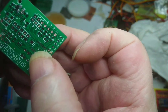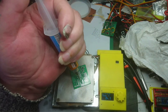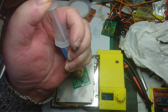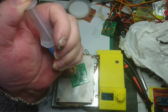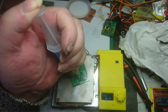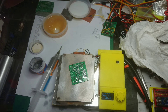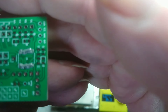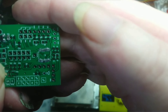As you can imagine, these ones - there's no way in hell I'm going to put, I don't know how many legs it's got, I think about 20 little dabs on there. No way - it's just going to cover them all. So what I do to start with is I just put what I think is enough across them all, like so - just enough to coat all the tabs. So that's ready. I just put enough - that will actually be enough for the tabs of the microcontroller there. I don't put the microcontroller on at this point.